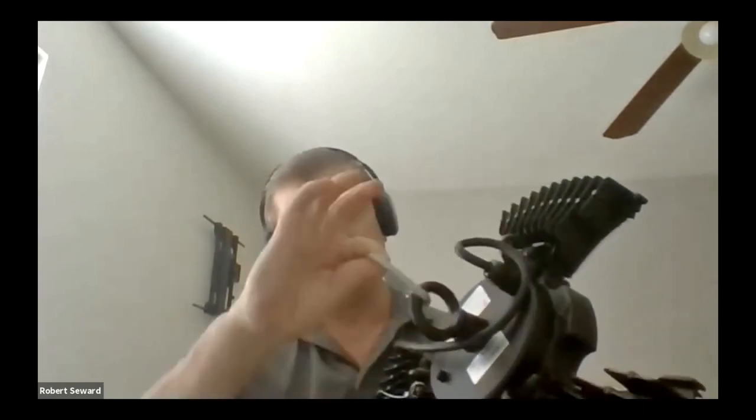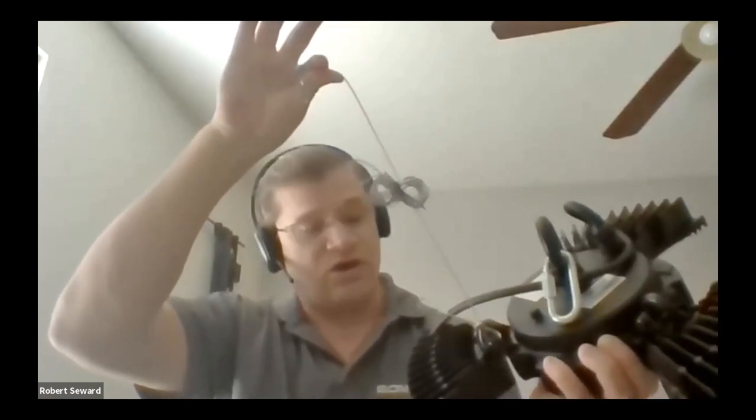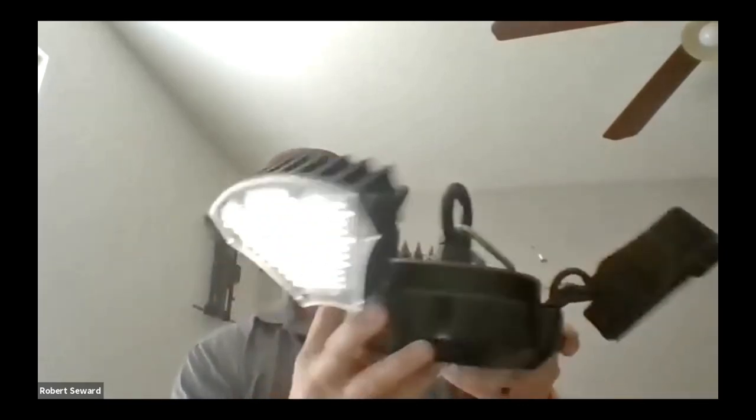You can see here on the mounting — this is the traditional hook, and it comes with a clevis just in case it's needed. We can also do the rigid mount, so you'd have a three-quarter inch rigid conduit coming out of the ceiling and it would thread right in. It also comes with all your safety cable included — no extra cost. These come automatically with the fixture; if you don't want them you can take them off. This gives you a better picture of the optics. Each one is at an 80 degree beam angle, but you can change it by tilting. This shows a typical tilt that people use, and this is what it would look like underneath.